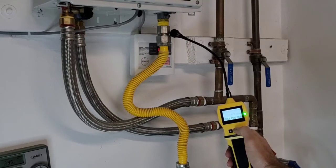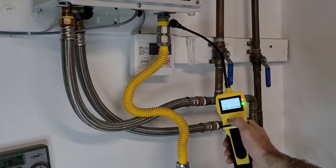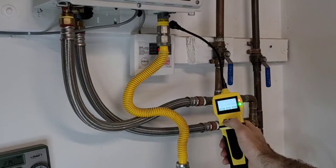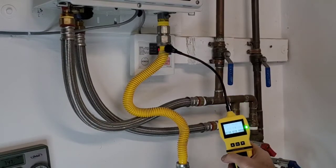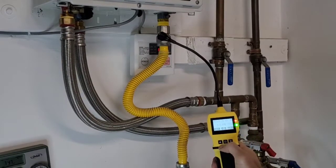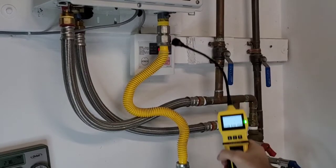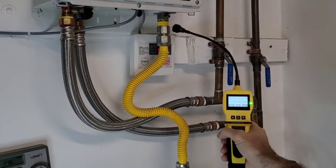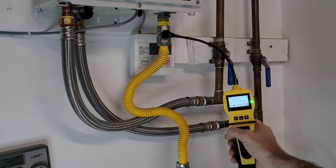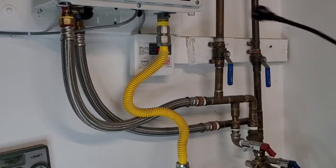If there's nothing there, move on. At this junction — there you go — we have a leak over 3000 and we've confirmed the leak right there. If we hold it elsewhere it's going down, then going up again there. We do have a leak. Some leaks are small and may not be high enough to trigger the alarm, so be patient. Go very slowly, especially at the joints and junctions — wherever there is copper or a nut and thread connection. That was the 90E yellow version.